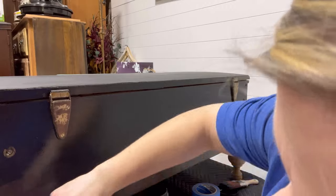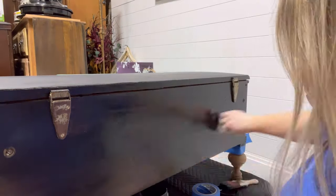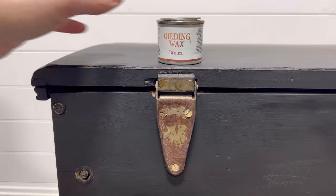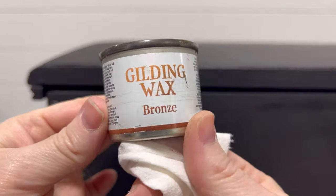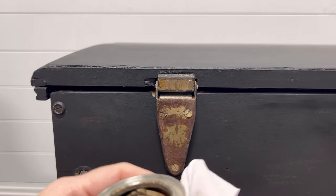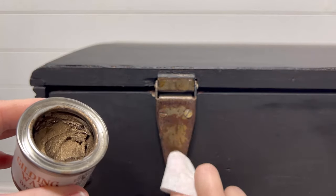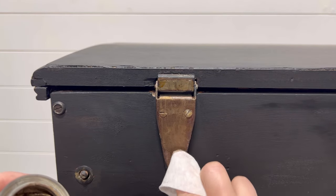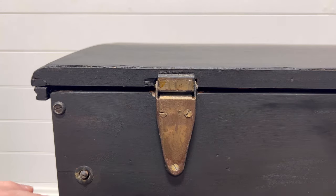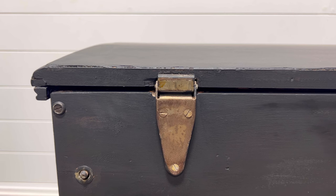Once you finish with your paint, come back with a paper towel to wipe off any excess, then as needed come back with your brush to cover up any streaks. For the rusty hinges, I went over them lightly with a 200 grit sandpaper to knock off any rough edges. I'm going to bring them back to life using gilding wax from Dixie Bell — I chose bronze because it matches the original color and complements the black very well. Gilding wax is oil-based and you don't need to seal it because it cures hard once it's had adequate time to dry. I like to apply it using a soft paper towel or lint-free cloth, though you can also use a small artist brush.